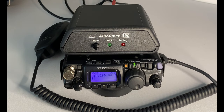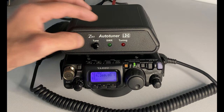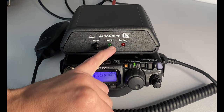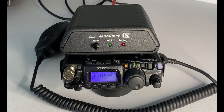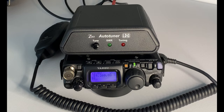The tuner has two different cycles. The first is a full manual cycle — you simply go to your desired frequency and press and hold the tune button momentarily. The red light flashes to indicate it's tuning, and when it has found a match the SWR green light comes on. Worth noting: when you initiate tuning, the tuner itself switches the radio to packet data mode and lowers the 817's power to minimal to perform the tuning operation.